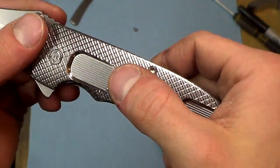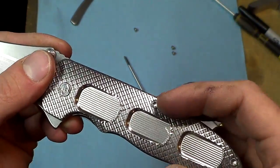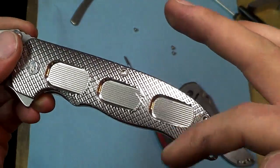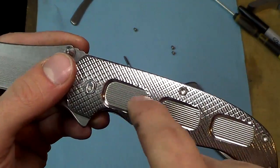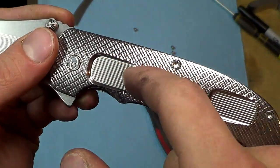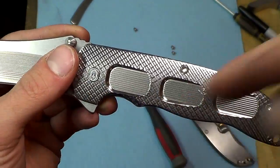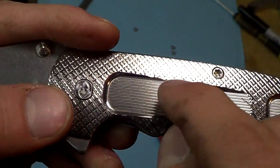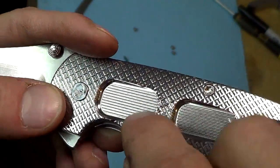One of the biggest reasons that I did this pattern was mostly just to try out 3 different toolpaths. For the main face of the handle, I've got a parallel toolpath that basically criss-crosses. And then here I've got a linear toolpath — also a parallel toolpath, but just going one way, not criss-cross, at this angle, not 45. And then I've also got a trace toolpath that goes in here and follows the little loop, just to clean up.